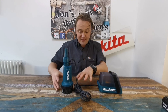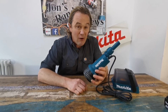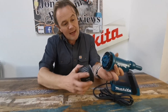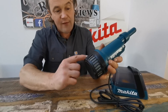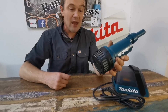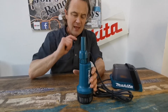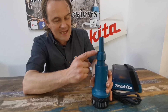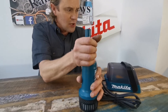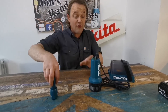So let's go through it. This is the body of it — it's not that powerful, but we'll have a demo in a bit. This is the filter bit on the bottom. It's got a little impeller on it and quite a fine filter. If you were in a really mucky situation, like pumping out a really mucky hole, that filter would probably get blocked up quite easily — you'd have to keep cleaning it out. On the top I've actually adapted it with a fitting — it's a Hep2O fitting — that goes to a bit of 22mm copper, so I can put a three-quarter hose on that. If you wanted to put a normal hosepipe on, it's got a three-quarter thread on it.